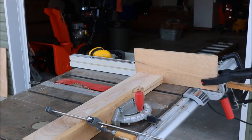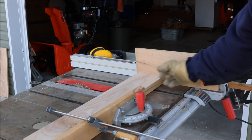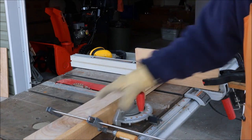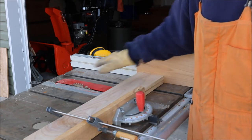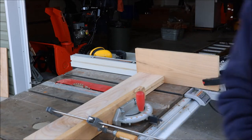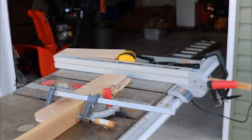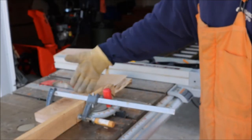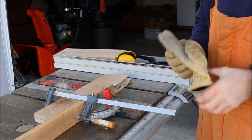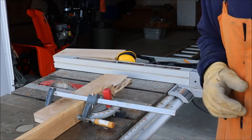You can see what we did here — we measured 8 inches from the blade to this piece, then we clamped this board on there. So by the time this board hits the blade it won't be jamming, and it'll be exactly right for both of them. We put two on one side — it's a good way to make sure they're exactly right. You can see I clamped the long side here because it's short sides there, and we're just going to cut a few inches off. Then we have 8 by 12, exactly what we want.